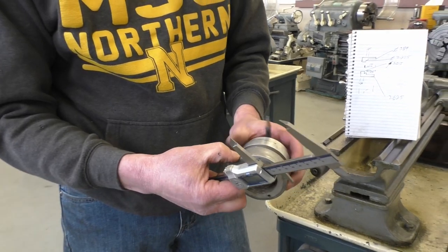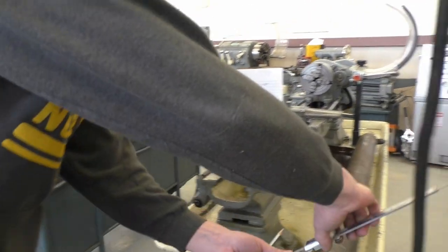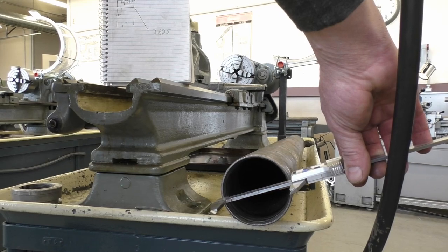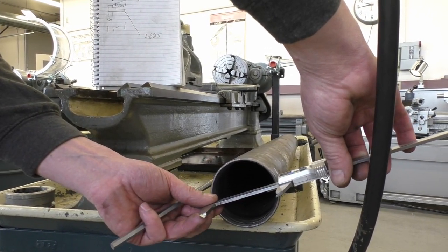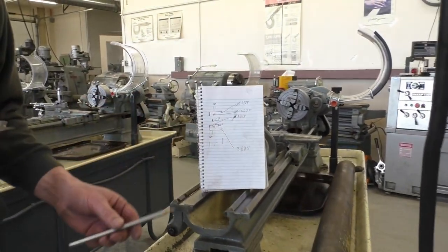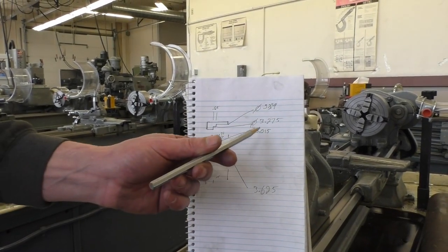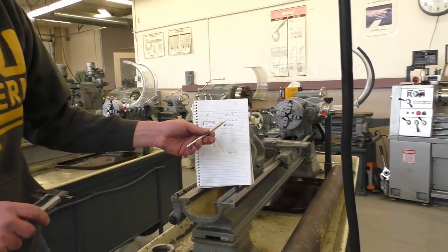It's aluminum and there's a little bit of scuff marks on there. If you measure the tube, it is actually bigger because it needs to slide in there — they have it at 3 inches 34 thousandths. That's too much slop for me on my head. So I made a happy medium when I machined mine. I'm going to make it 3 inches 25 thousandths, giving myself 10 thousandths clearance. So that's my first measurement.